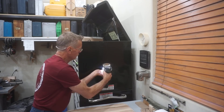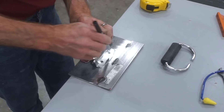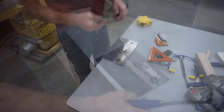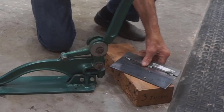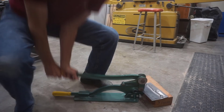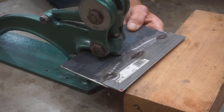Since I'll use existing bolt holes to attach the French cleat to the toolbox, I remove the toolbox handle so you can see how the steel gets positioned. I lay out the cleat for handle bolt hole locations so everything is oriented correctly for final installation. A quick tap on a center punch helps with hole locating when using this old Whitney punch for making quick, clean holes. There's a nib on the punch that I index with the dimple from the center punch, then with firm force on the handle I easily punch clean holes five-sixteenths of an inch in diameter through this one-eighth inch thick steel plate. Unfortunately the throat of this punch isn't deep enough to reach the second row of holes, so I have to resort to a regular drill bit for those two.